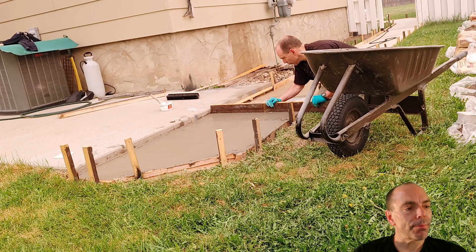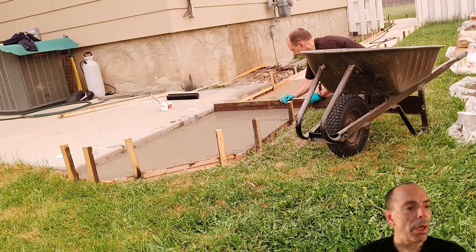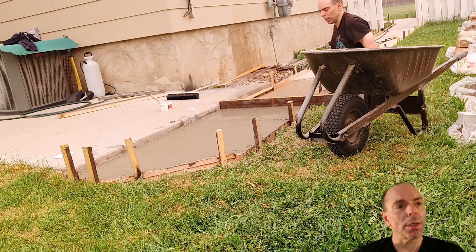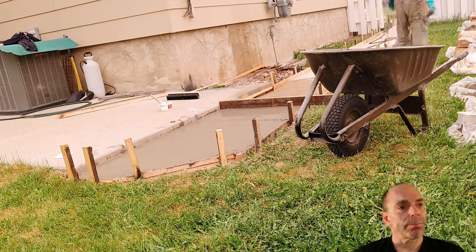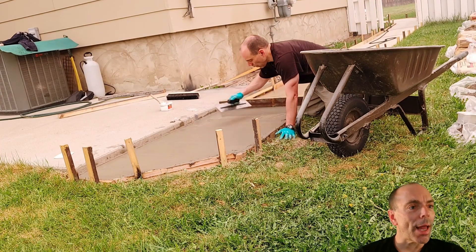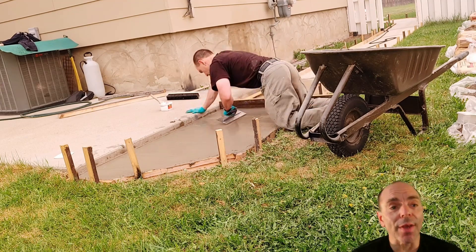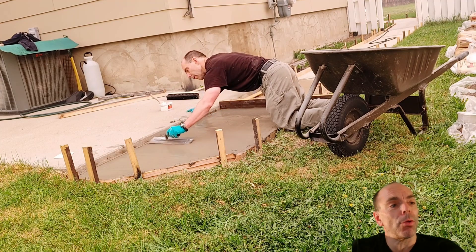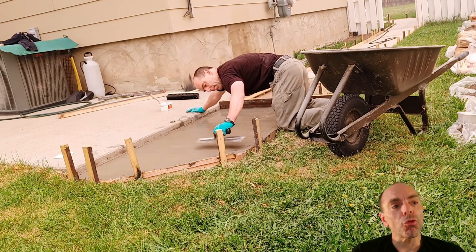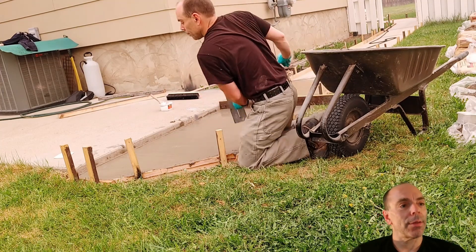Here's the best example. Look — I just poured a bag, I'm almost done with my two-by-four screeding, and I didn't wait. I go and take that trowel right away. You're not supposed to do that. Look at all that beautiful mud I have on top — I create that barrier, and the air inside the concrete that's going to want to get out, I've blocked it. If you trowel too early you create delamination — the air is not going to be able to evacuate. This is terrible.